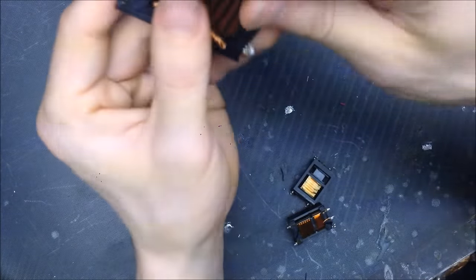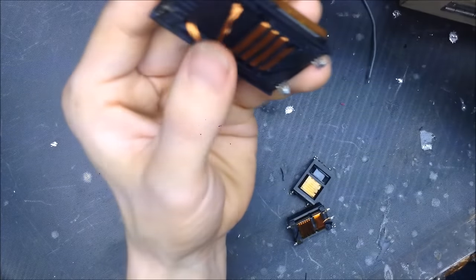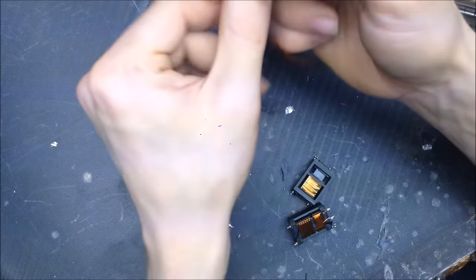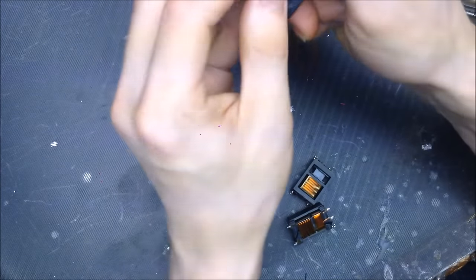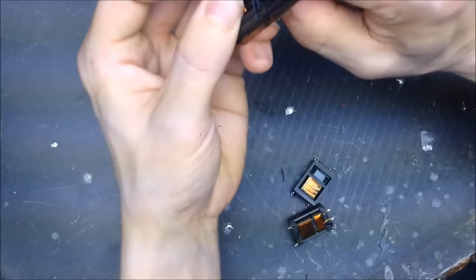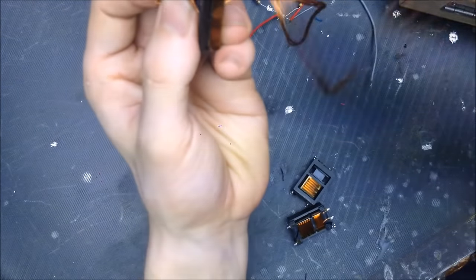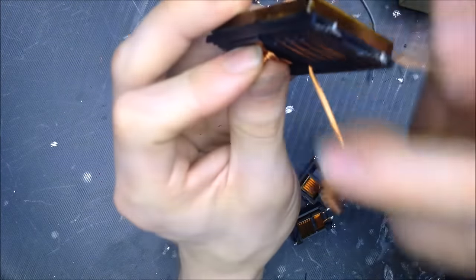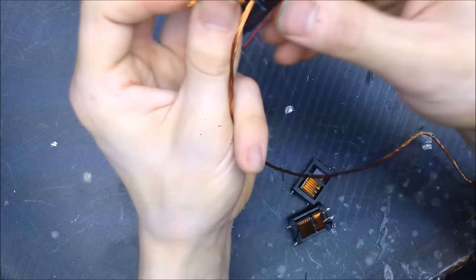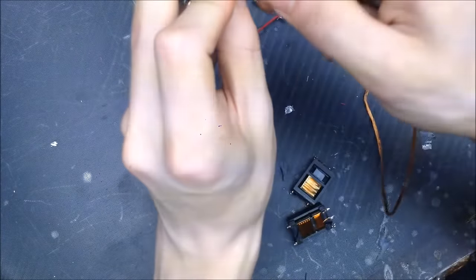I didn't get as much wire as I thought I was gonna get out of this, so it's gonna be interesting to see exactly how many turns I'm left over with once this is on. I have no idea. I'll be lucky if I make six. So it's definitely going to be a low voltage, high current coil that I'm putting on. Figure maybe 10 volts at something like 20 amps. Well, not 20. Maybe not a 200 watt core, but 10 volts at 8 amps. If you do 10 volts at 8 amps, that's 80 watts out of this, no problem, depending on the duty cycle.